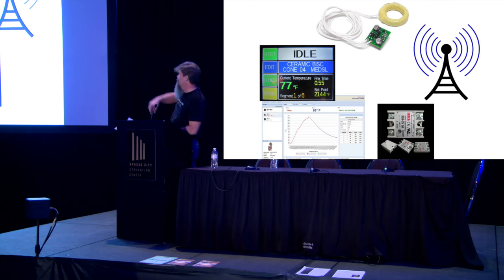So it's wonderful. And then up there on the top, that's a current sensor. These have existed for a little while now. They're standard on some kilns, not standard on others. But what those let us do is take some of those measurements. Like, we can measure the amperage draw of the kiln. I can measure, or calculate to a degree, the resistance of that circuit. So if I'm coupling these things together, my kiln could say, hey, I have a problem. And you sit down at your computer and ask, well, what's the problem? I ping the board. The board says, okay, I'll run my diagnostics, and throws them back and says the resistance in circuit 2 is low. Okay, I need to go look at circuit 2 then. And it's going to be able to tell us these things.